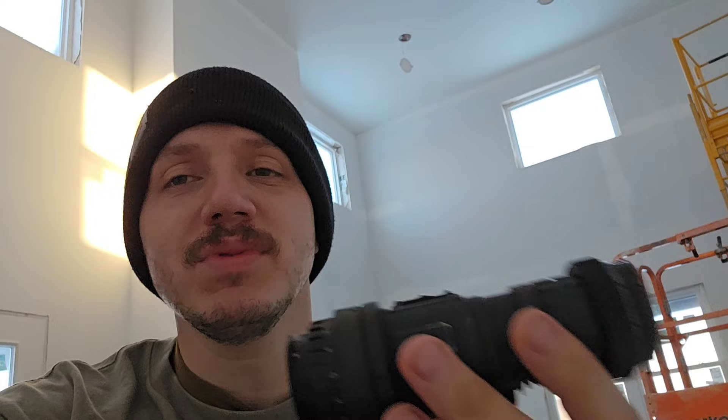So it would meet Omni 5 specs. It is an aviation grade tube — it is very clean and I definitely enjoy using it. That's why I put this one over my right eye. The other one should also be an Omni 5 aviation grade tube, but I can't guarantee that because it was repotted, so it doesn't have the original housing and doesn't have any of the information on the tube. But the other one should also be an aviation grade Anvis tube.